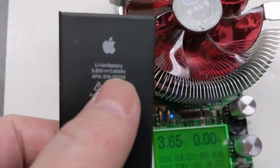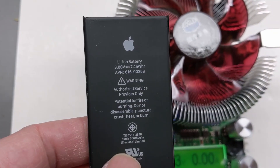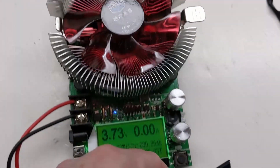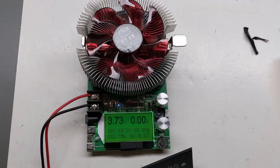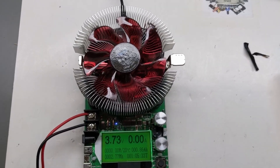When it's supposed to be 7.45 watt hours for this particular model, at a nominal 3.8 volts — so that'll be 2.7 to 4.2 volts as the nominal or average voltage of the pack. I hope you found this video interesting: a capacity-diminished Apple iPhone battery on the load test. If you like this video, please like, share, subscribe, and thanks for watching.